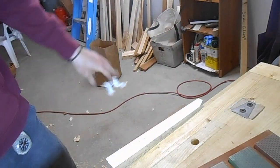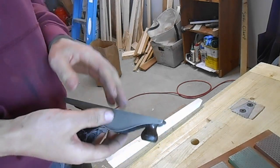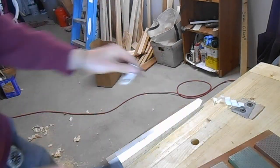Even with all the explaining, that took me very little time compared to doing all the sharpening by hand on flat stones. Using the hollow grind on the fast grinder makes it such a breeze. One thing I was doing while using the grinder that I couldn't tell you about because it was too loud: I was keeping a close eye on how hot the blade was getting. With aluminum oxide stones versus these standard corborundum stones, these get much hotter than is ideal. You don't want the blade too hot to touch, because that can damage the blade so it won't hold its edge anymore. Every once in a while if I noticed it was getting too hot, I did have a cup of water there that I was dipping it in — but usually I don't have to do that if it's just a touch-up operation.